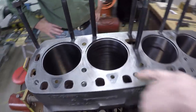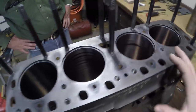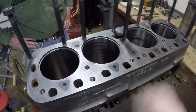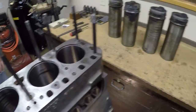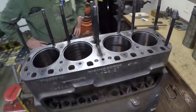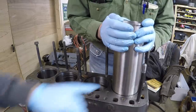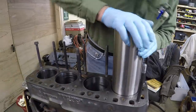We cleaned all of these bores out with clean oil and a rag until everything came out clean. We're not ready to wash the block yet because we still don't know if those sleeves are going to need honing after we install them. Next step: pull some of those sleeves in with a light coating of oil on the sleeve and cylinder wall.